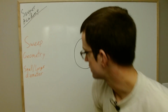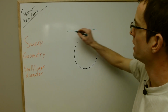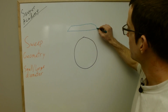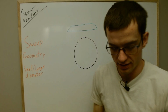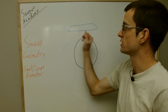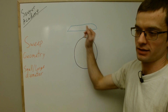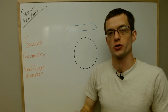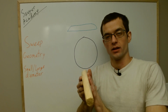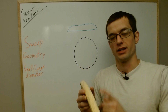And what that looks like is if you start with your belly, you're going to end up having to trim off both ends. You won't end up with a nice square cant. You'll find that the ends are always going to have wane, and then you're going to have to trim off 2 feet. So that's why we're always going to start face one and face two on these parallel faces with, again, belly up or horns up.